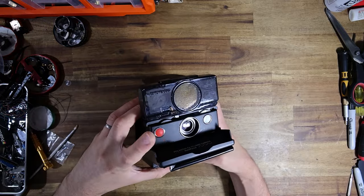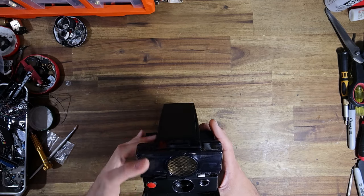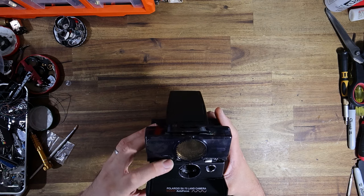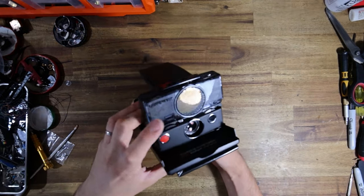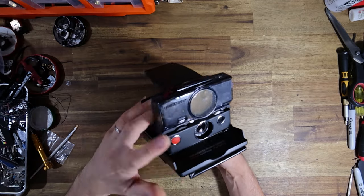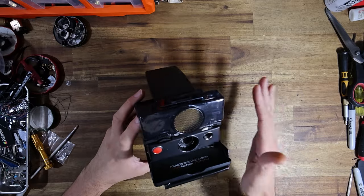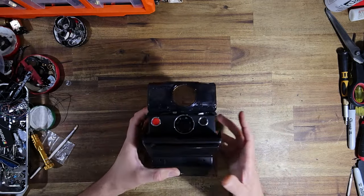and send it all the way home, or you can, let's get it to lock first. There we go. Or what you can do is just manually focus it back to infinity and it should work again. So that's going to work assuming your Optosensor hasn't failed. That's how you reset a Sonar autofocus.